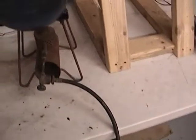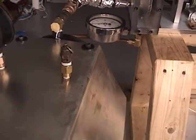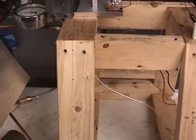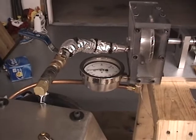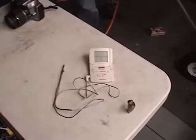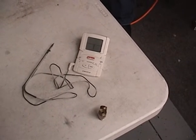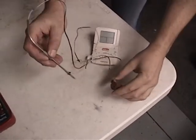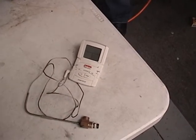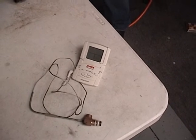It didn't make it. So, for added safety, we have a pressure relief valve set at 115 PSI. The first test we ran, we were running boiler outlet temperature, which we assumed was the same as turbine inlet temperature, and we had a small accident with this temp sensor. JB Weld says 6,000 PSI, but unfortunately that's not the case — you can see we had some damage done to our fitting there. The turkey temperature probe was also not rated above 200 degrees Celsius, so it just said high. So we're going to have to estimate that temperature as well.